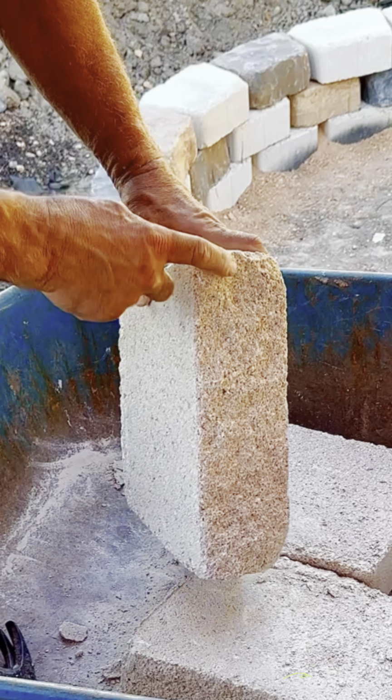Part 2, Custom Round Stone Fire Pit. Let's continue. I cut down the wall block layout into a template to lay the blocks in a perfect circle. I made it 2 inches wider on each side to have extra space. The pink line is where I cut it, and it's the inside radius of the wall blocks.